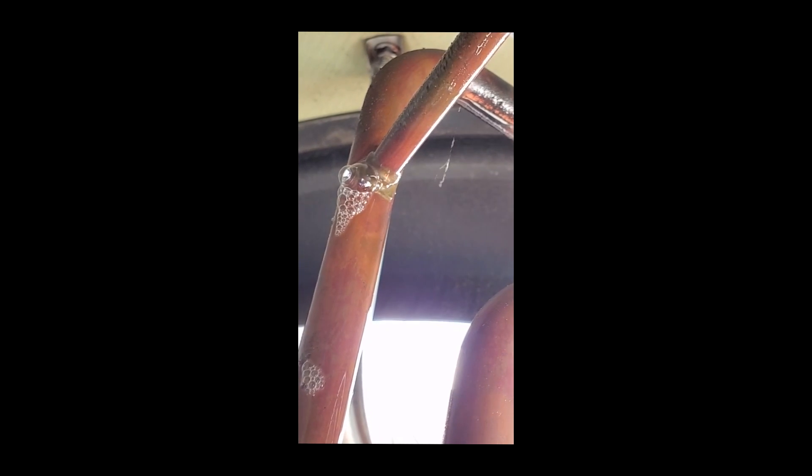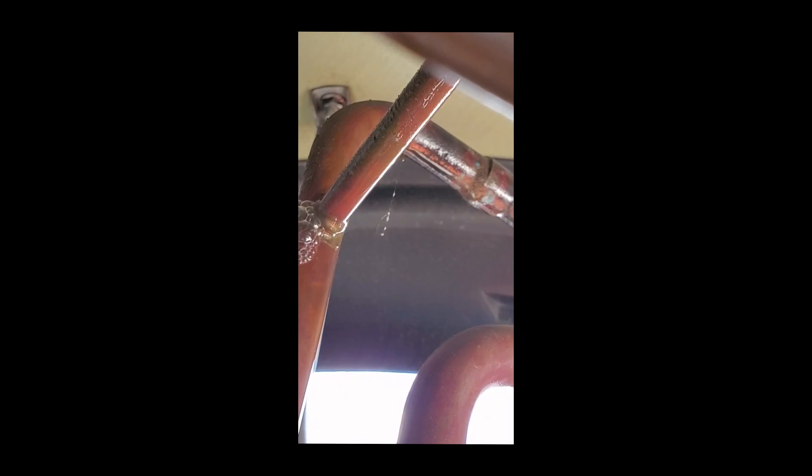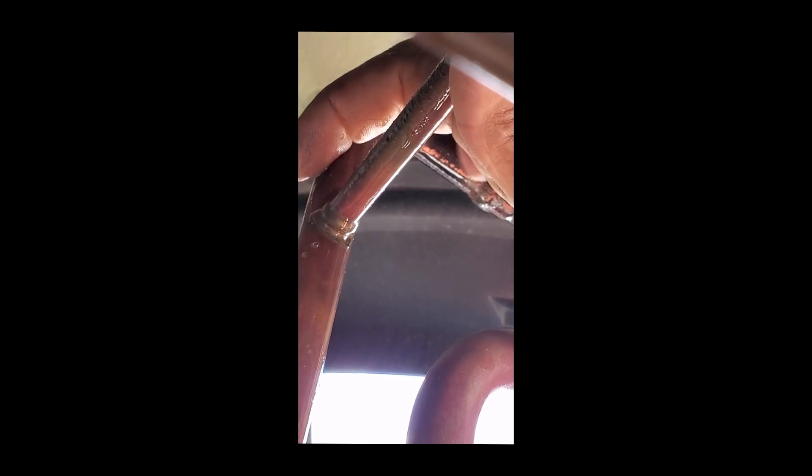Because I don't got nothing but about 25 PSI in this one - see that. The good news is that I should be able to fix these. So I got one on circuit A right here. I'm really trying to pinpoint in my mind where that is. I could use a marker or something, put a circle, but I kind of know where it's at. So I'm gonna go down and get my torches.